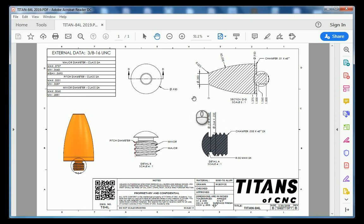The very first thing we're going to do is take a look at our blueprint. Looking at our very first front view of our part, notice the overall diameter is 950 thousandths. We have a section view going from D to D which can be found to the very right of that. We've got a whole variety of different diameter and radial measurements. Notice in section DD we have a detailed view, and detailed A can be found right below, with some clarification on the measurements of the threads.